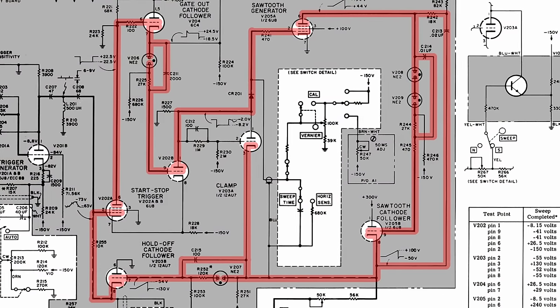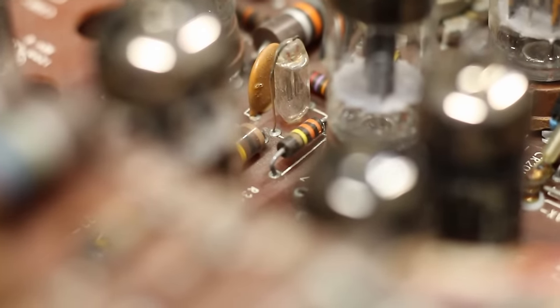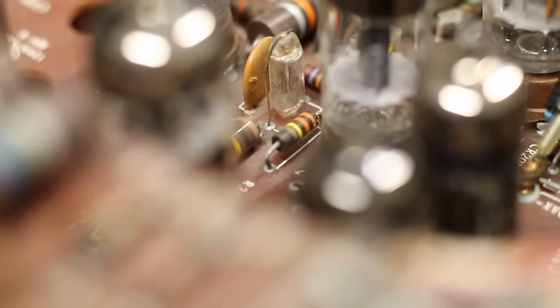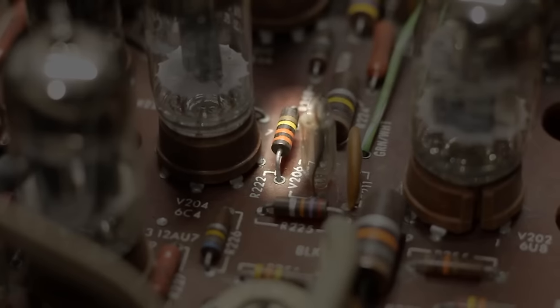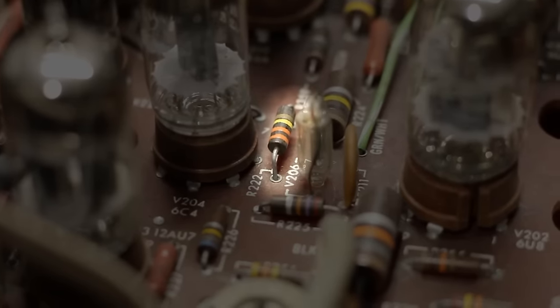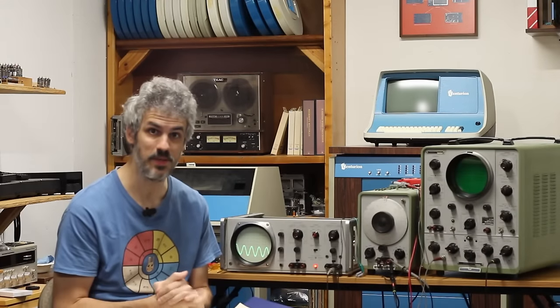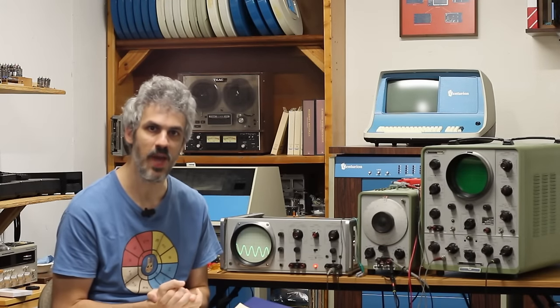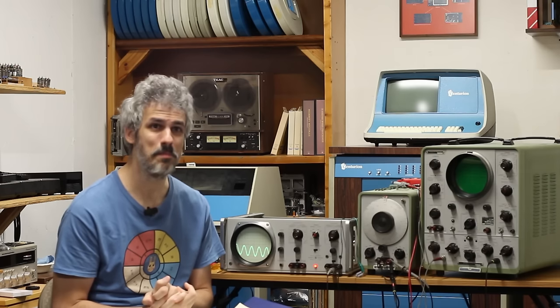I was pretty much at my wit's end, and I came out late last night, and I was looking through and I noticed that one of the resistors looks different. Like it's been replaced at one point in time. One of them is a different color. It is black instead of brown. And it measures out within spec. I mean, it's orange, orange, yellow, so 330K, and it measures to pretty much exactly 330K, except that it's not supposed to be 330K.